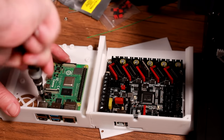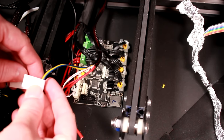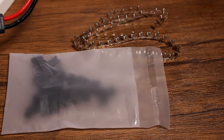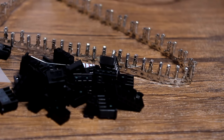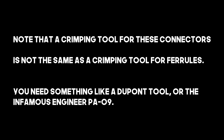This case is really clever. It's just a matter of putting the wires back where they should be — it helps if you labelled them when you took them out, or at least took pictures. Enders use 2-pin plugs for the end stops, which is non-standard; the standard is 3-pin. The board came with a bag of plugs and crimp fittings to make the necessary plugs. For some things like the part cooling fan, these were just bare wire into a screw terminal, so you probably need a crimping tool anyway — worth having.